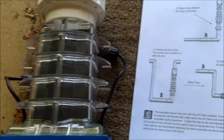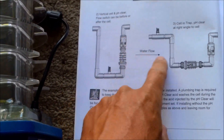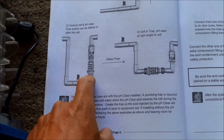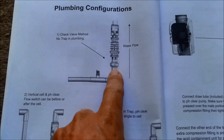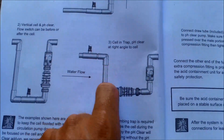I'm going to go ahead and plumb the salt cell in. The manufacturer wants you to plumb it with a little valley or trap in case you want to add the pH clear as an optional product afterwards. You want to plumb it kind of in the valley where the salt cell sits down, also right above a check valve. I'm going to use this configuration right here.